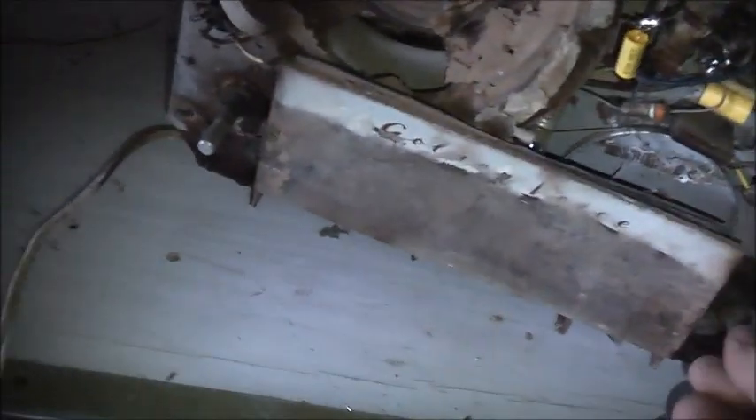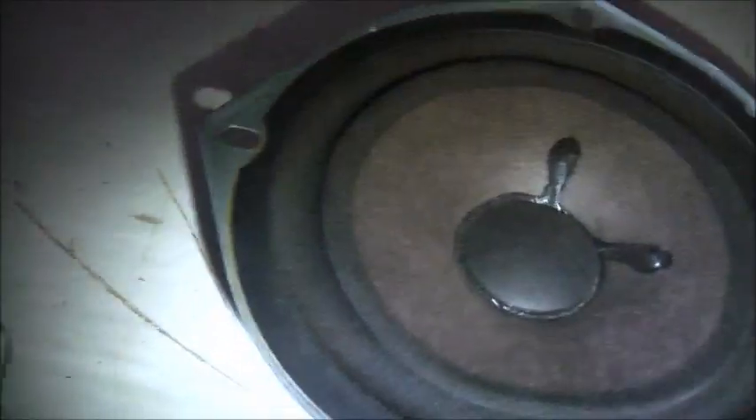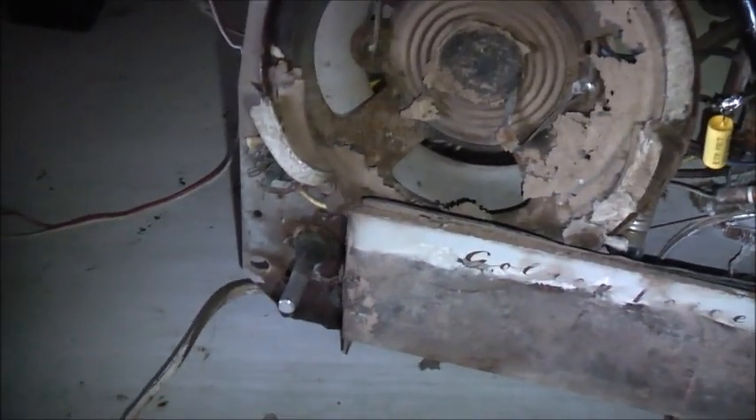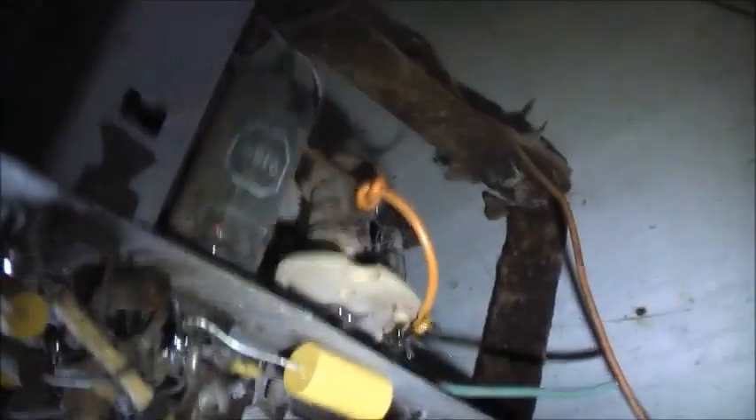It's going to look like I'm tuning in. I think that's a station - not too bad. There's a heterodyne, squealy and scrapy sound because those condenser fins have got corrosion and they're scraping together. Those condenser fins will have to be cleaned. The audio valve doesn't seem to be getting hot, so that's good.